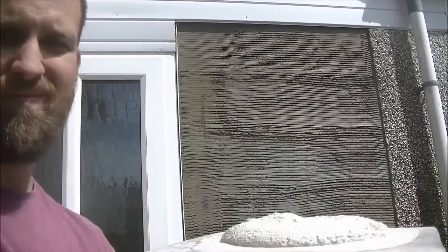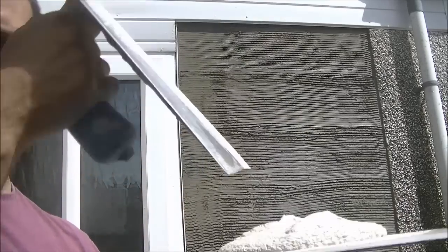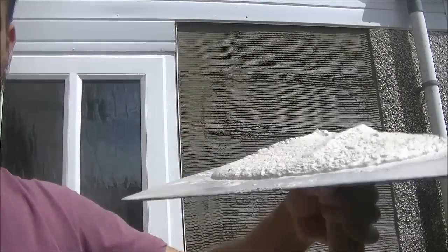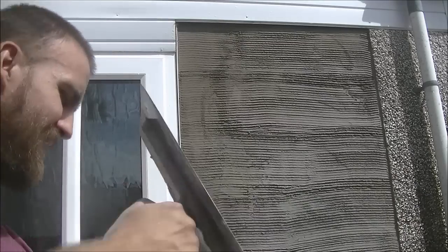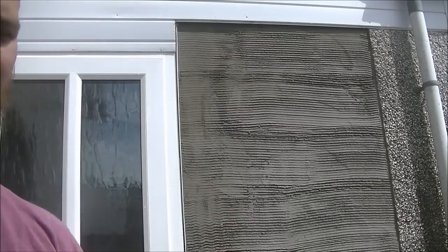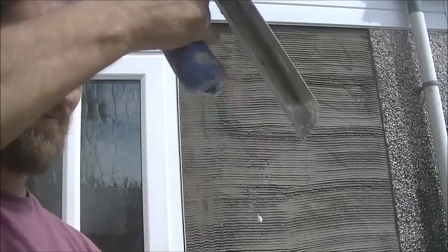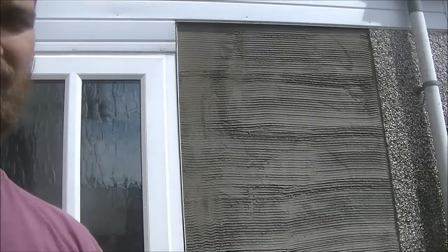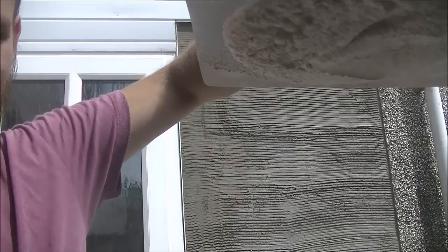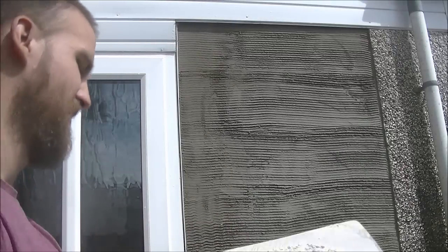So you can also see that I have soaked down the wall ready. It's got a scrape and a soak down ready. Just trying to show you the texture here. Nice sticky sort of mix. Obviously it needs to be sticky for the stones to adhere to, and I've mixed it just maybe a wee bit wetter. There's lots of body on this. It's nice and fluffy. Waterproofers in it as well,